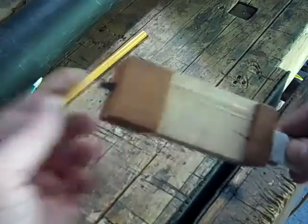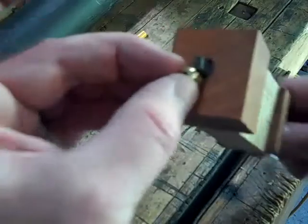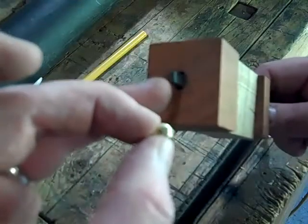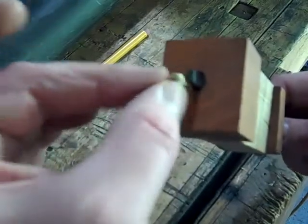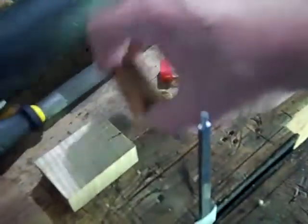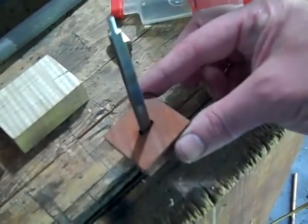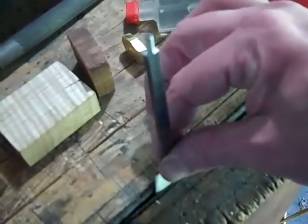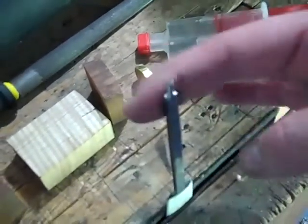The very last thing to do: I'm going to put this brass rivet at the end. I've drilled a one-eighth-inch hole through the center of it, and I want to round the very end of the tang so that it'll fit nicely through that on this stick-tang knife. There's going to be a little bit of a sloppy fit, so I'm going to use epoxy that will fill those gaps and retain its adhesive strength. That's why I'm using epoxy on this particular knife.